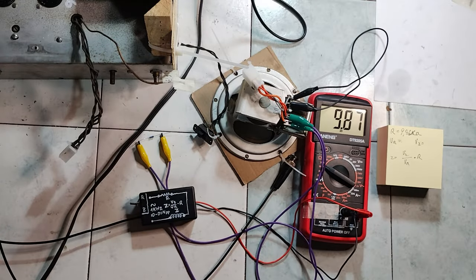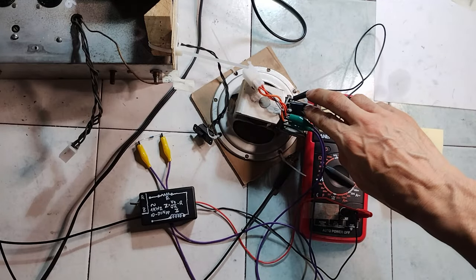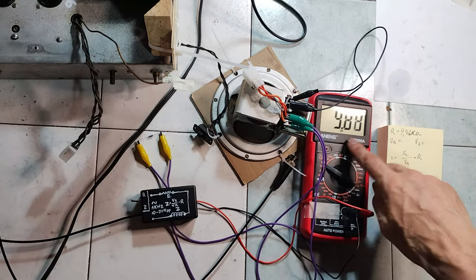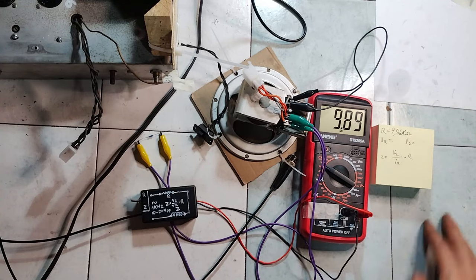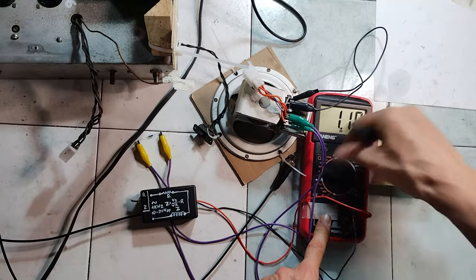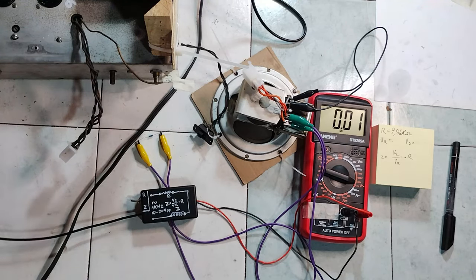This clip shows the process starting with the loudspeaker connected as it should, with the help of a jumper wire. Initially, the multimeter is used to measure the value of the chosen resistor. It is about 9.86 kilo-ohms. Then the multimeter is set for measuring AC voltages, and the signal generator is connected and activated.